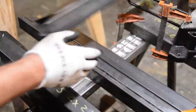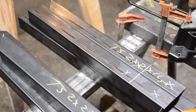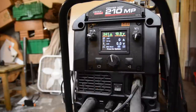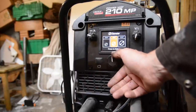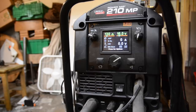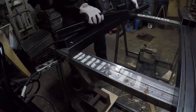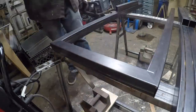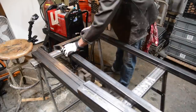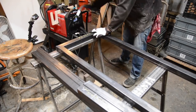That's the left and right sides of the upright back. I'm making sure opposite sides are exactly the same, and that crossmember is going to sit at your lower back. Here's my Lincoln MP210 — I'm just getting my settings right for 16 gauge. The computer panel helps you get there easier and I just bumped up the voltage a little bit for more penetration. I had two camera angles going — a GoPro and my Nikon — and here I am tacking my frame.